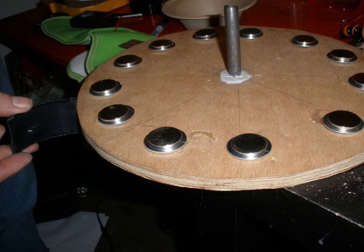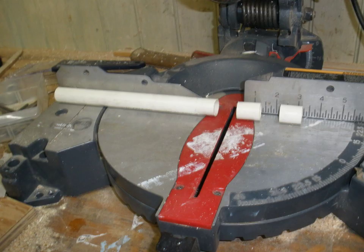Step 4: Pre-assembly. Before we can start assembling, we need a couple of other things. In the parts list, there is a half inch steel rod — we need to cut that down to about 8 inches or desired length. The best way to do this is by using a hacksaw. Next, we need to cut the spacers. If you have a half inch or three quarter inch scrap piece of PVC plastic pipe, lay it out and cut that into 1 inch chunks.